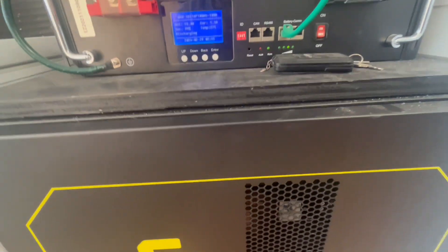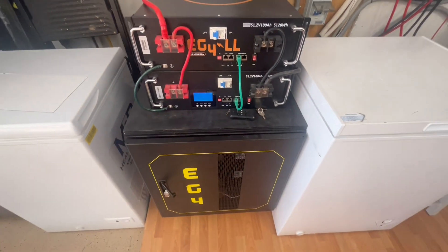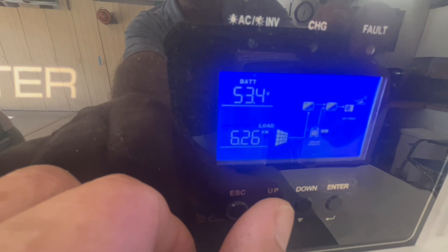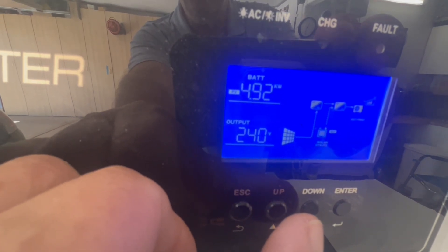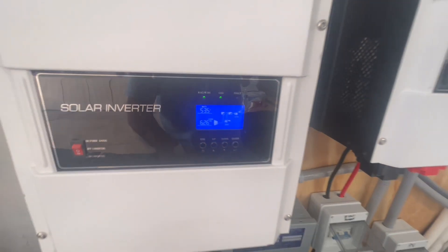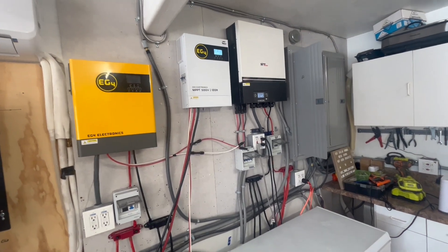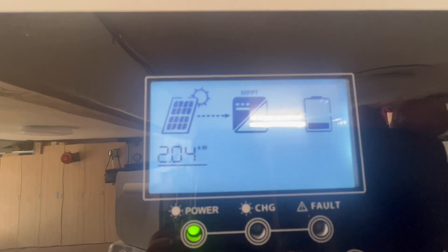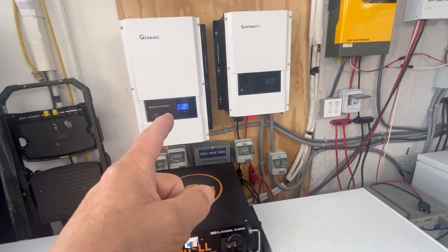Right now we can see we're discharging at about 0.6 to 1.1 amps per battery — so with five batteries that's about 5 amps total coming out, which is really not too bad. We're at about 6.25 kilowatts of usage, bringing in almost 5. The EG4 is bringing in 2.04 kilowatts right now to supplement the amps and keep our batteries charged.